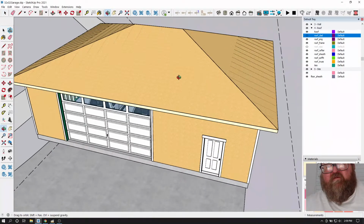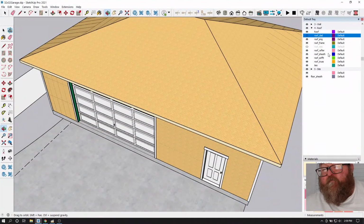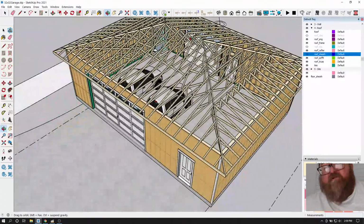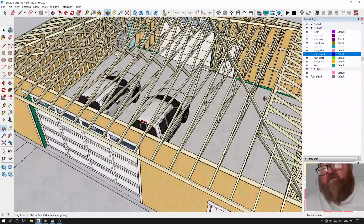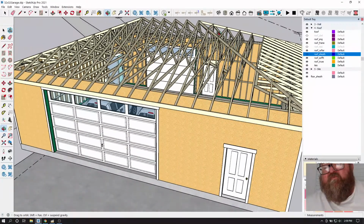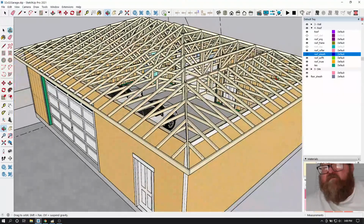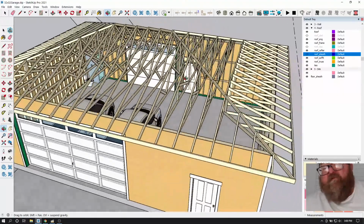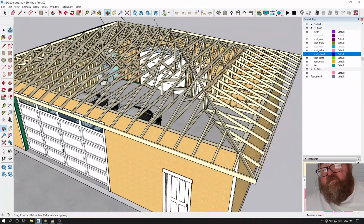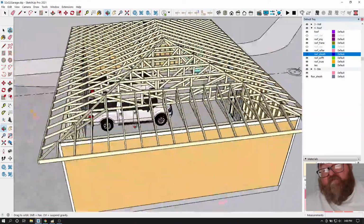He's working on that. But honestly, just to be able to have those, you can see there's like 10 different types of trusses. I'll turn up that sheeting. We got our common trusses. We've got these 5 trusses in kind of an array that step down. Then you got this girder. Oh, that's part of the 5, isn't it? 1, 2, 3, 4, 5. This girder truss is a little different because it's got to carry the load of these. And so that's 1 type, 2, 3, 4, 5, 6, 7, 8, 9, 10, 11. There might be 10 or 11 different types of trusses on here.